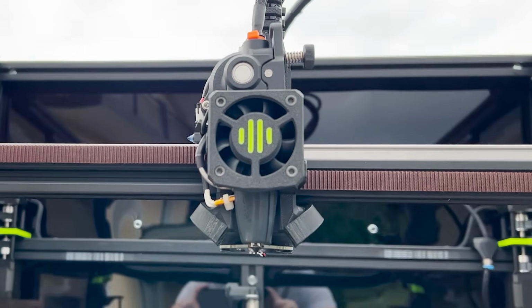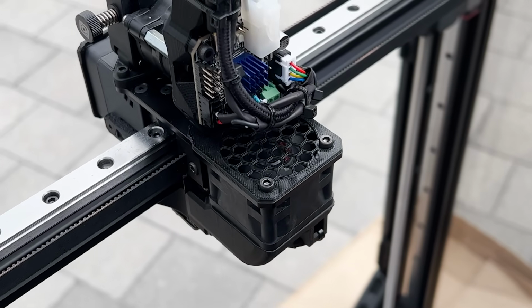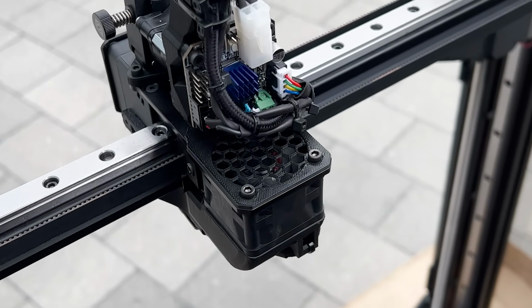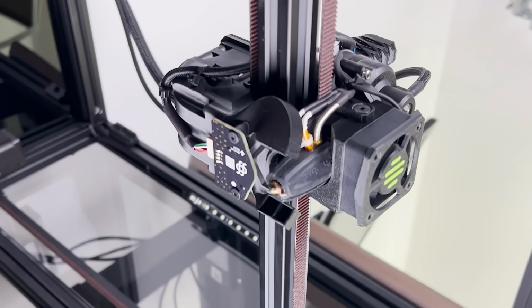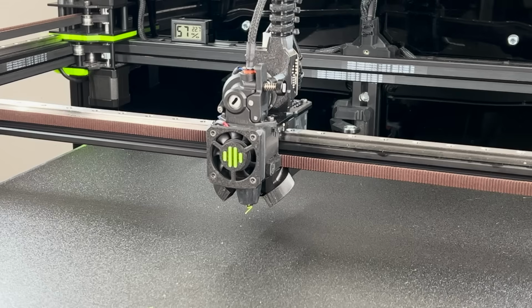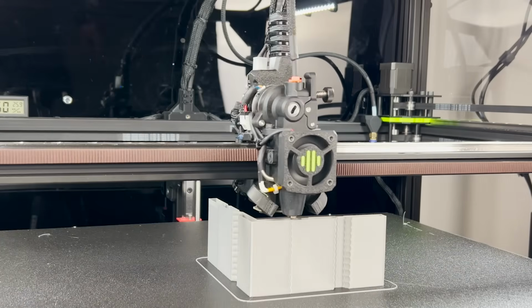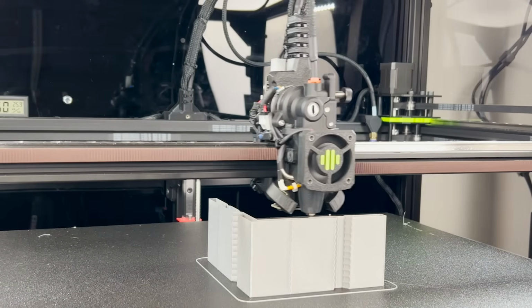This new toolhead features a Phaetos Rapido 2 Ultra High Flow hot end, an Orbiter 2.0 extruder, an EBB42 toolboard, a 4028 15,000 RPM part cooling fan, and the famous yet expensive Beacon surface scanner. Gone are the days of tinkering with separate ADXL sensors, as both the EBB42 board and the Beacon scanner now integrate acceleration sensors. While this default setup may not offer top-notch extrusion flow or ultra-lightweight components, it serves as a solid and modern starting point for a do-it-yourself printer like the VCore 4.